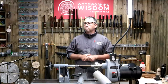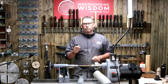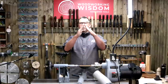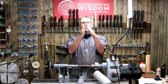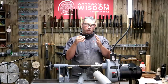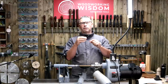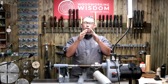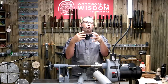The bevel angle on the signature skew is a combined angle of 50 degrees — 25 degrees each side. You may not get that precisely from the factory as many are hand linished. Don't worry about it — stick with what you've got for now, you'll get used to it. The only time I'd say change it is if it's extremely acute, meaning coming too far back, because the further back you come the more aggressive they get.